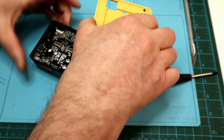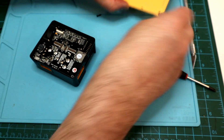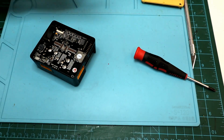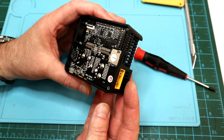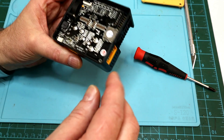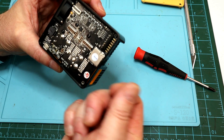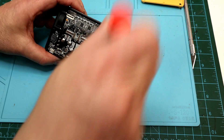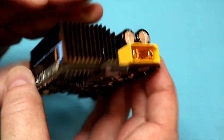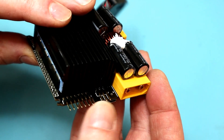It's kind of clipped in a little bit. The screws will stay in there — we'll just keep them in there so we don't lose them. So yeah, this thing is just packed full of electronics. Now we've got to get the board out. If you've got a micro SD card in there, make sure you take that out, because it'll be sticking out a ways and it'll catch on the case.